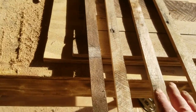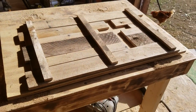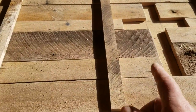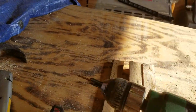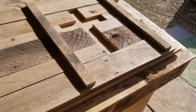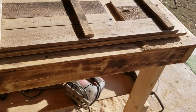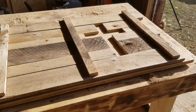I'm building two of these today. I've got three slats: one near the end over here, one near the end over here, and one running alongside the edge of the cross. You don't want to get too close to the edges because you don't want to split the wood. I've got my countersink — I'm not really going to countersink as much, but I am going to pre-drill the holes just to keep the wood from splitting. I don't want the screws coming out the other side.